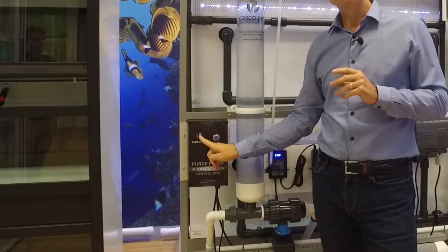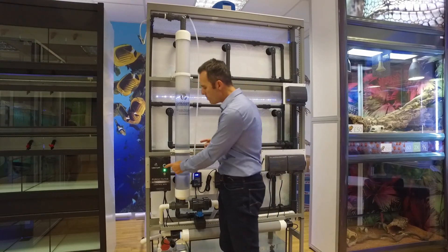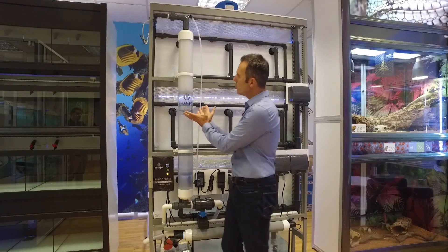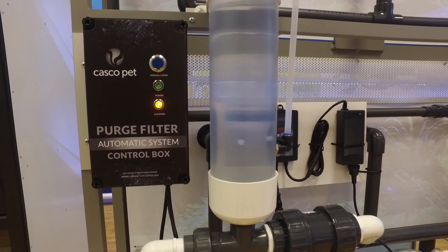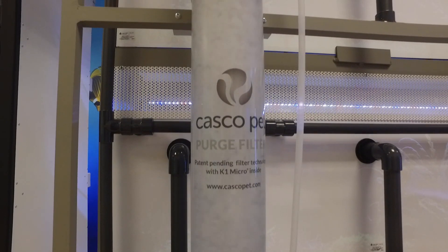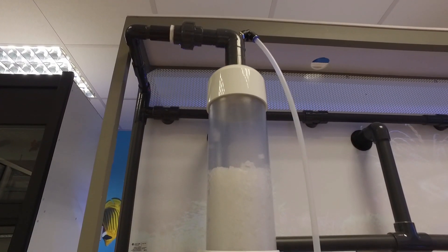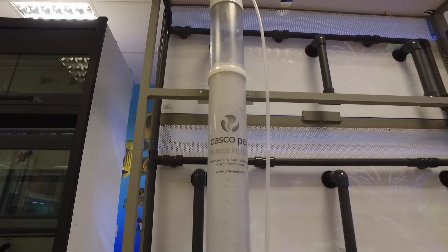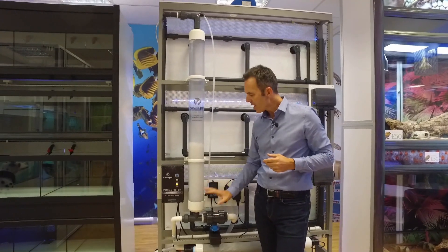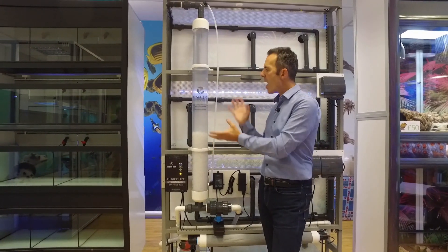It does that automatically by taking instructions from this timer box here. What I'm going to do now is show you a manual filter purge. By pressing this button, you'll see that this filter bed goes through a washing process and it expels the dirt that it's captured. The dirt has been collected pushing that way under pressure, and now we agitate that media and release all that dirt. The water that you'll see starting to go away is going off to waste. This filter is both revolutionary but not rocket science — there are very few moving parts and very few things that need servicing or can go wrong, which is why it's patent pending. Look at that — all the dirt now washed away, massive amount of agitation. That's gone down the drain. And in a few minutes this bed will refluidize and the water will be back and we'll be back into filtration mode.